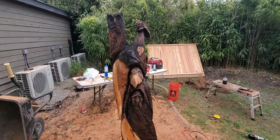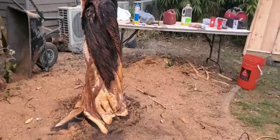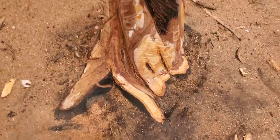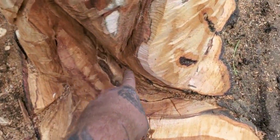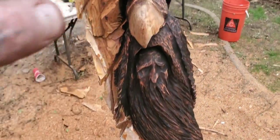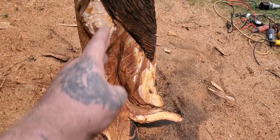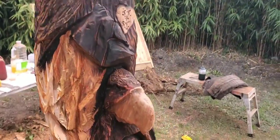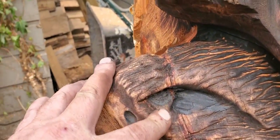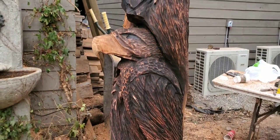I'm pretty tired but the rocks are carved in here and down below. When you do bigger outdoor carvings, always make sure there's room for water to travel — no low spots where water can sit, because that will rot the wood. I've got all the spots clear for water to travel down. Tyler's going to have a garden around it once landscaping is done. Before I go I'm going to set the abalone eyes in the eagle head. It dips a little from the bark but I'm happy with it.